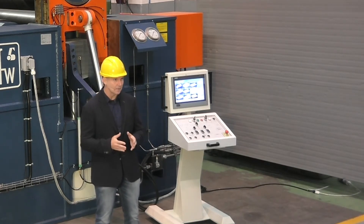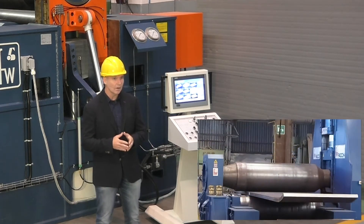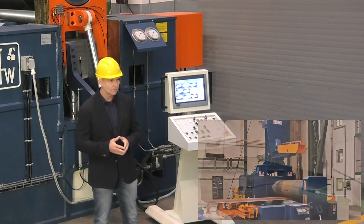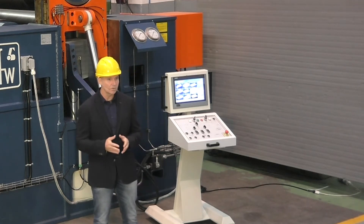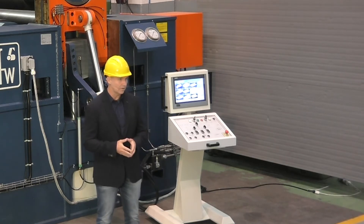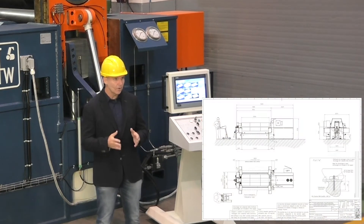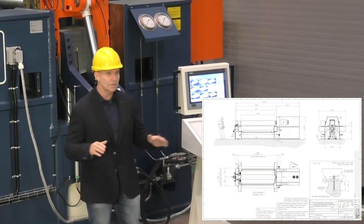From an operational point of view, the initial pinching phase is fast and safe as the plate is always parallel to the ground and not inclined, as it happens in traditional three-roll pyramidal rollers. This also allows the use of motorized feeding tables with automatic alignment systems, available as an option in different versions, recommended for an easy and quick insertion of the steel plate.